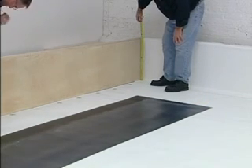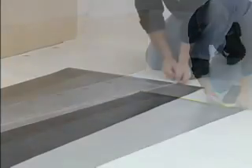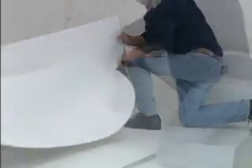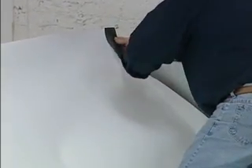When the adhesive is ready, measure the height of the wall, add 6 inches for the flange, and chalk a line. Pick up the flashing, fold the end of the sheet back 3 inches, and set the wall flashing tight into the corner.